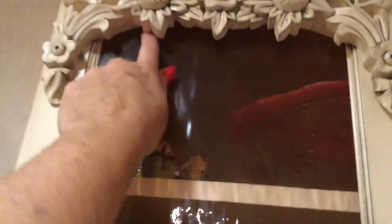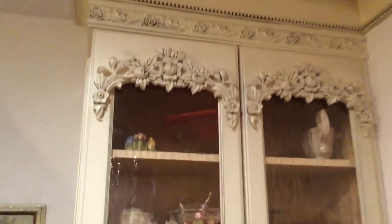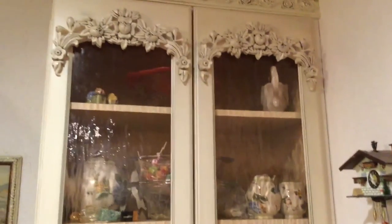So it was basically making a frame with a very rough arch, so that the decorative edge actually shows. We then put an onlay on top of that to hide the curved edge, so it becomes this fancy cut edge. When you're looking at it, it looks like an arched curved cabinet.